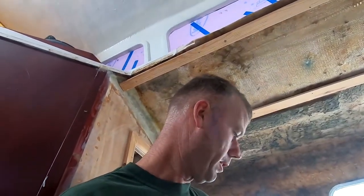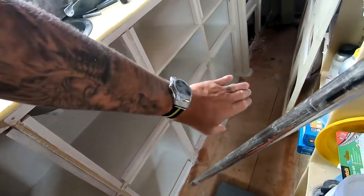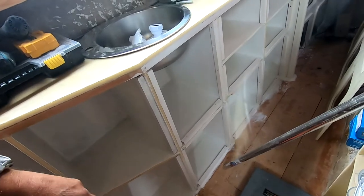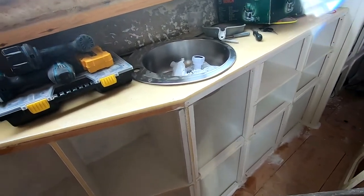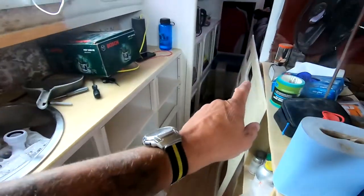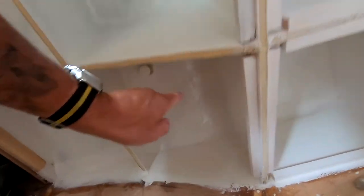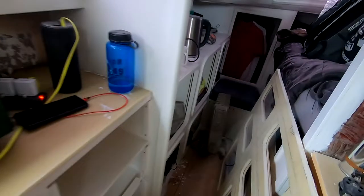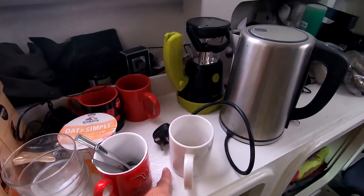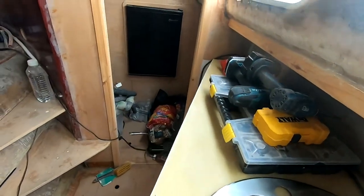I've got back this morning and I've put a few little bits of trim in, fixed the front panel on, and applied a second coat of epoxy primer just to give it that final coverage. Tomorrow - or maybe this evening, last thing - I'll get some 2K in there, just get a nice tough coat on there. Pretty much put those lockers to bed until I get the frontage on. I've still got a lot of work to do on the front, I need to get the drainage sorted out on the sink. I'm also trying to get hold of some Formica - the DIY stores near me don't have it, they've only got sticky-back plastic that would fall to bits if you put a hot saucepan on it.